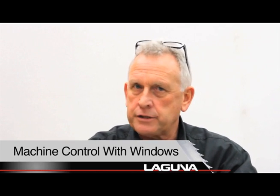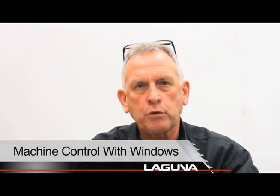Prior to that, the controls didn't have those interfaces, and Windows was really used not to control the machine, but to create a user interface that was a bit easier to use, and it could connect to the networks. So you could connect a computer to the wireless network. In those cases, the Windows computer was always kept separated from the machine control. The machine control never relied on the Windows technology. That way, if Windows crashed or something happened, your machine still ran. You didn't lose your setup.